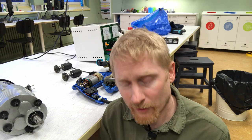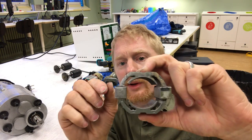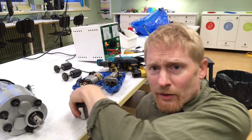I learned a few things today and I hope you have too. The magnets I used were slightly oversized — ones I had laying around — 50mm long and 15×15mm square, magnetization grade N48, which is a pretty strong magnet. The temperature endurance is 80 degrees so it's a low-temperature magnet; if I'd ordered specifically for this project I would have chosen narrower magnets to avoid wasting magnetic field out into the air. Nevertheless, great power from this stator. I'm now going back to the inflatable car project, working on modifications for easier storage and transport, and also the brake system — stay tuned and I'll see you next time.